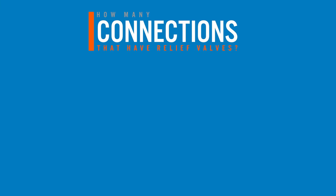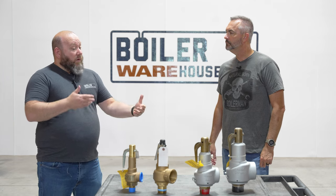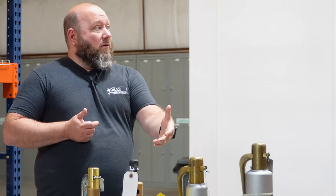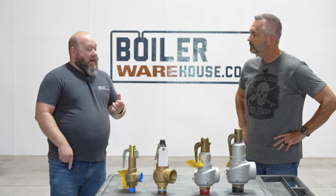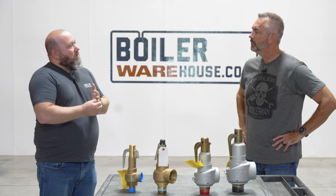We need to know how many connections you have on the boiler that have relief valves on them, what the boiler horsepower is, and what the boiler MAWP — the maximum design pressure that the boiler is rated for. When we select relief valves, we have to make sure we have enough to exceed the pounds per hour requirement for these steam boilers to relieve enough steam so that if you have an over-pressurized situation, you can evacuate enough steam to not over-pressurize the vessel. You might be asking for one relief valve, but I need to know what else is there and what their relief capacities are.